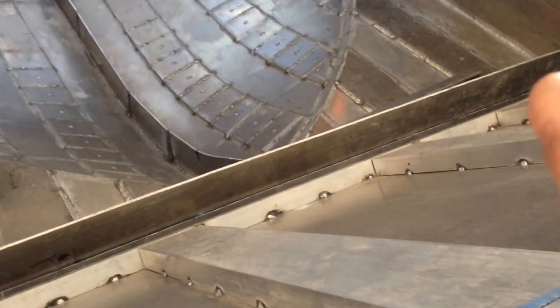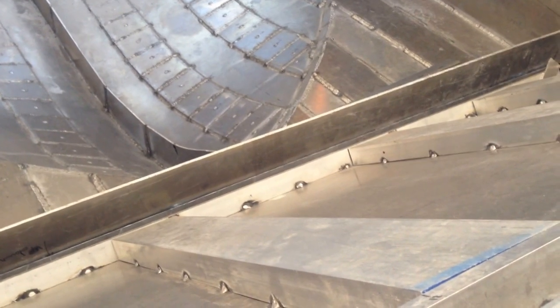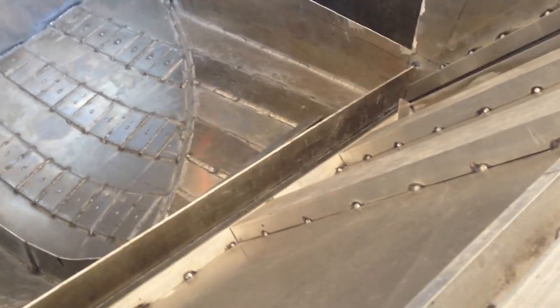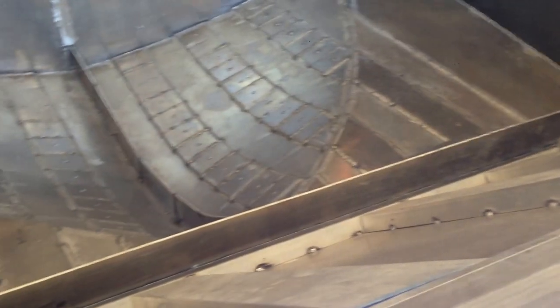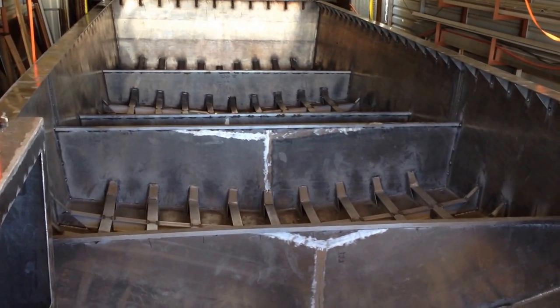One more thing: you can see a gap right here. I bought an aluminum hinge — they come in six-foot lengths. I'm going to put a hinge across here with another piece of metal welded to it. When the front door lays down and you're trying to use a wheelbarrow or dolly to load cargo, that hinged piece of metal will also lay down with the door and take care of the gap between the floor height and the front door. I'll show that more in the future once it's welded on. I'm at 25 minutes already — thanks for watching, and if you've got any comments drop them down below.